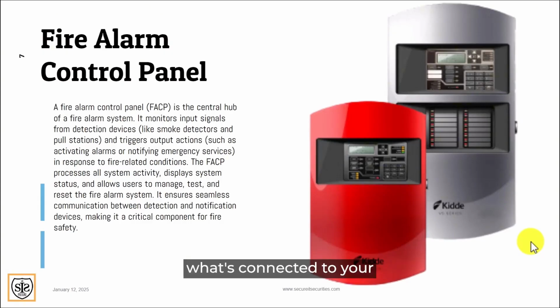All of these things are what's connected to your fire alarm control panel, in addition to where you could do some front panel programming. Not on all systems, but for this particular system, you could do front panel programming right from the display. Or if you have your laptop and 232 card, plug straight in, make some changes.